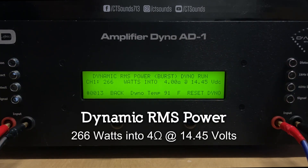We think this amp is pretty cool because it's versatile with many different setups at 1 ohm and 2 ohm. You're gonna need to know how to wire that, so in our manual we have different configurations. On pages 8 and 9 we have the monoblock wiring diagrams — here's how to wire to 1 ohm, here's how to wire to 2 ohms, and one of my personal favorites: two 250-watt subs at 4 ohms wired to a 1-ohm load.